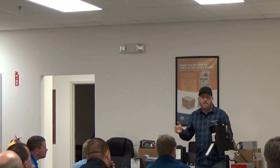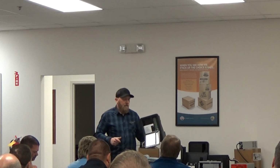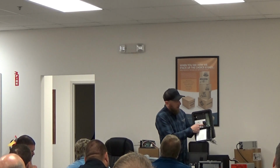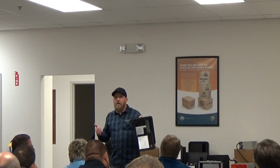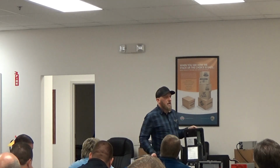This is a little bit different in some aspects from our 8955. It's the same thing. This is a 60 amp DC output, 8955 is 55 amps, but they're both three-stage charging. They're both load-based fans. All of that stays the same. Where this one differentiates itself is right here, you can't see it, but there's a little tinted window with 3 LED indicators. This is an incoming voltage LED indicator, with a green, yellow, and red LED. When you're plugged into shore power, you want this LED to be green.